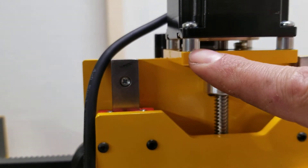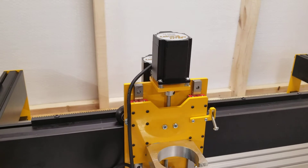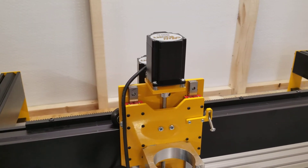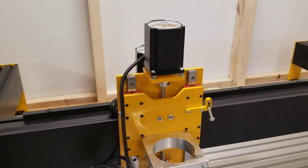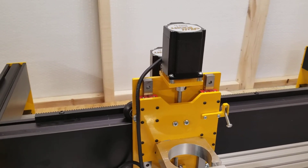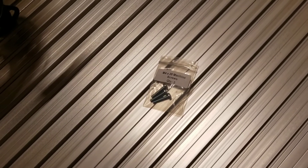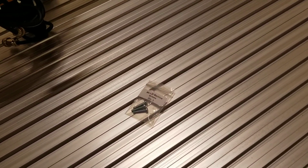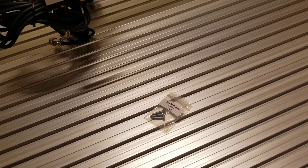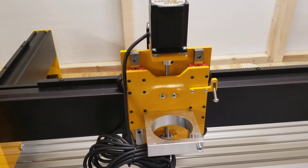I think it's only making it about halfway through the bracket that the motor mounts to. I did use blue Loctite on those so I shouldn't have a problem getting them back out. I'm going to stop by the hardware store this afternoon and pick up four M4 by 20 machine screws to put in there — 20mm long. In the hardware that came with the machine there are three M4 by 20 machine screws, and I almost put those in, but I realized there were only three, so I decided to wait and went ahead with the M4 by 14 screws for now.